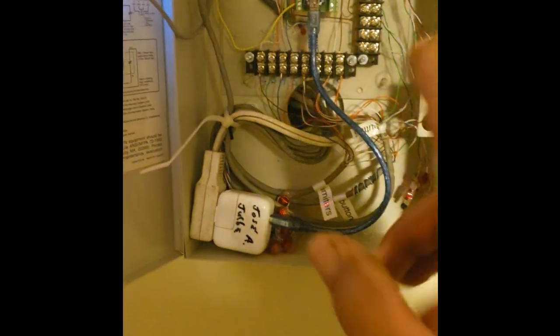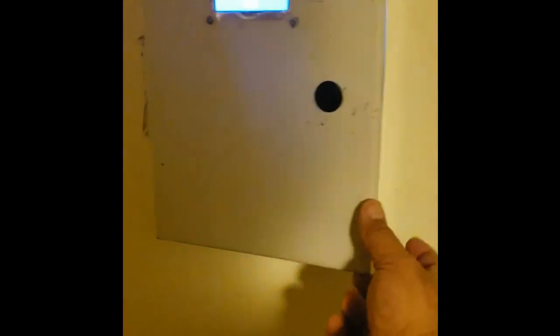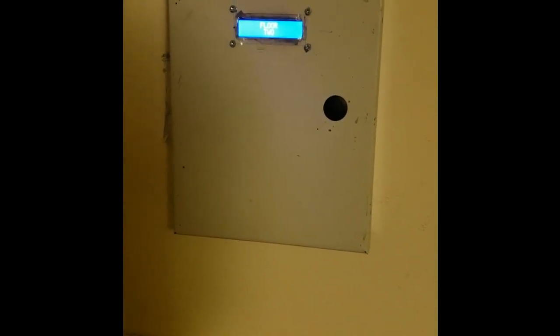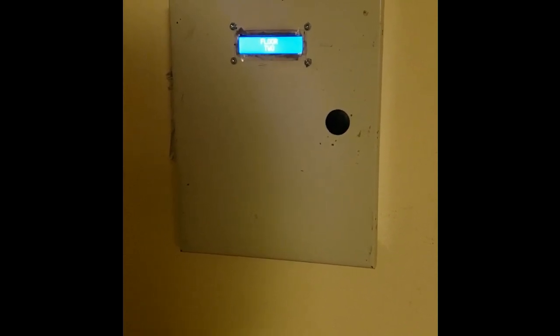This extension cord runs into that switch so I can turn it off. When I turn this system on it bypasses the manual control of the hoist. If you turn this system off, the hoist returns control to the hoist controller — the dangling one that normally comes with it. Whenever the elevator system is operational, it bypasses that manual control.